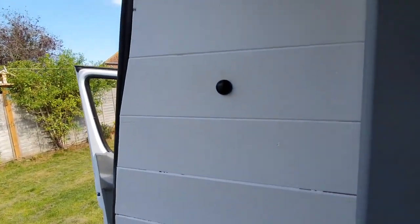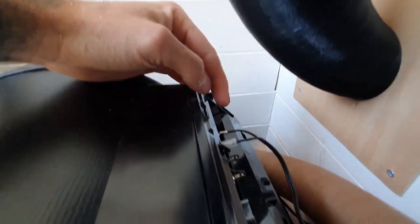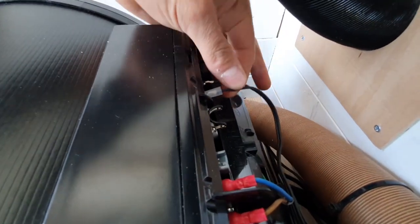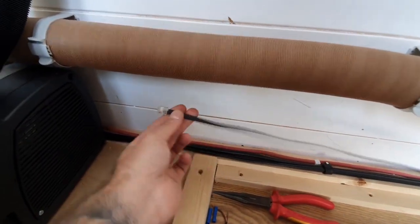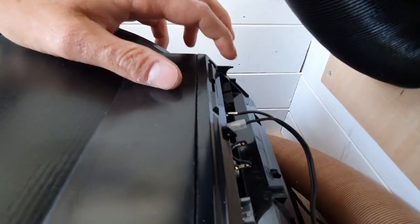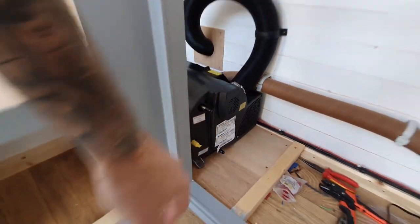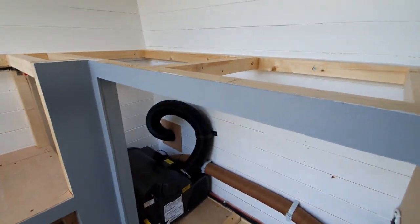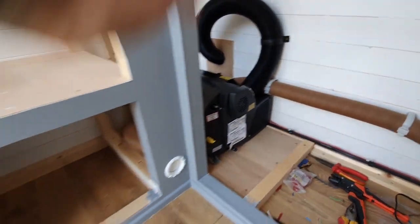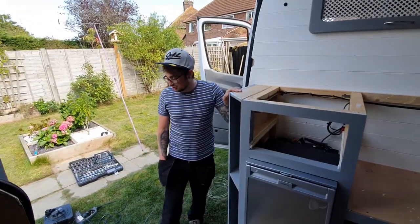It's in. Ben's taking the front apart and we'll drill the hole, route the cable - it's a pre-made cable - along here. There are only spade connectors on this which is great; they just plug into two terminals. That's the sensor sorted. The only wiring left on the boiler is this control or data cable which isn't long enough, so I'll get a connector for it - it just plugs into these RJ45 connectors. Next job: Ben and I are going to drill this dropout vent hole in the floor. The exhaust runs here somewhere so we need to measure up and work out where it's going to come out, drill a pilot hole, and go from there.